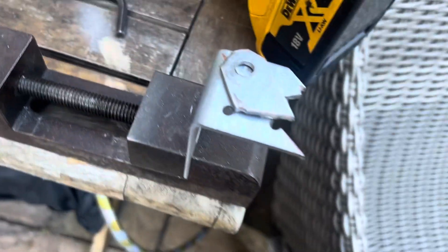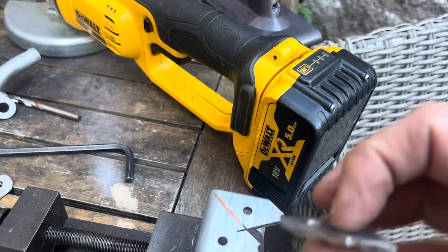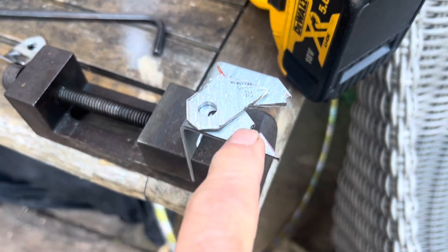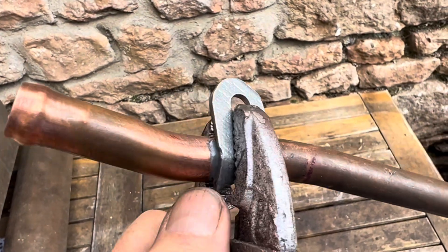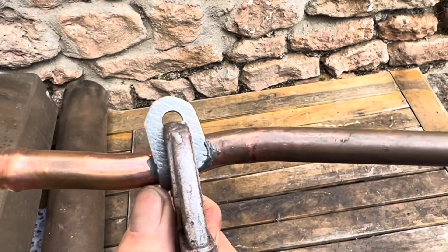Let's make this little bracket. We're going to use one of these L brackets from Travis Perkins - they're the right thickness - and we'll just cut out the shape and the profile there with an angle grinder. This has been gluing overnight. We mixed up two-part JB Weld. I didn't quite cut the bracket properly so I'm just going to have to sand that sharp edge off with a finger file. We'll leave that on until we take this to the powder coaters.